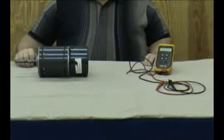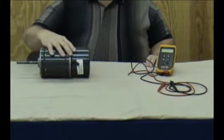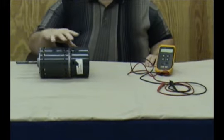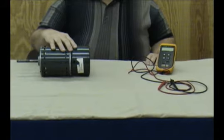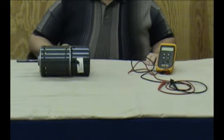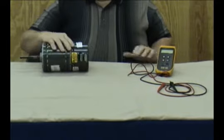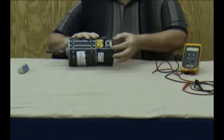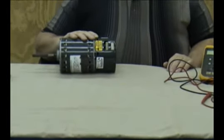One of the first things you probably learned, if not observed on the warning stickers of these motors, is that they retain voltage for about five minutes after all power has been disconnected — not after they stop moving, but after the high voltage power plug has been disconnected. Therefore, the first thing you do is remove power to your equipment, remove the power to the motor, and then wait five minutes.